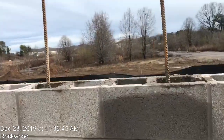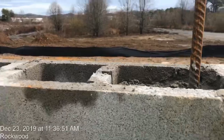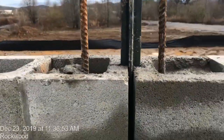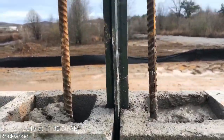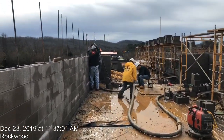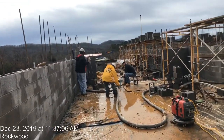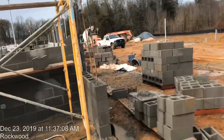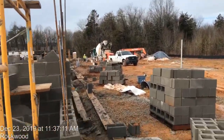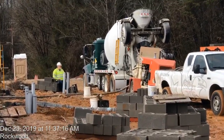You can see we have rebars, we have control joints, and we make sure the concrete fills all the cells. Here we have control joints with rubber and rebar on each side. We are using the two-inch line concrete pump with the vibrator. Here you can see the concrete truck mixer with the two-inch line pump to fill the grout.